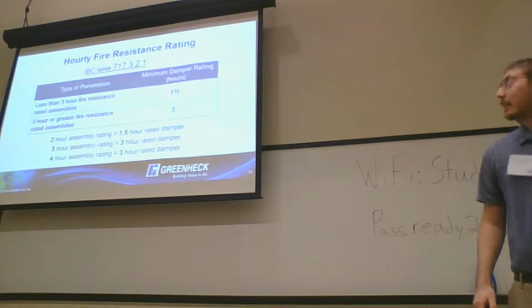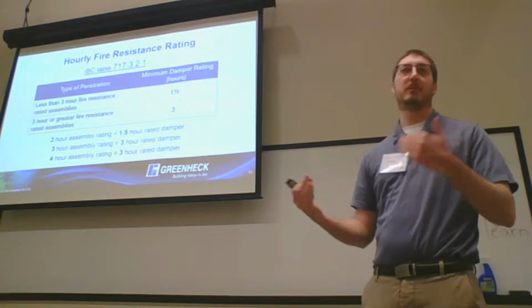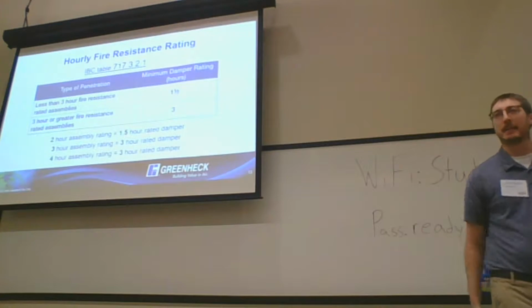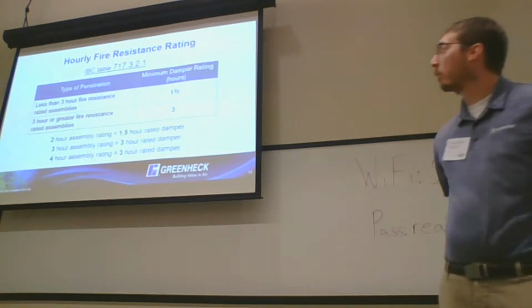All right, touched on this a little bit in the beginning. Hourly fire resistance rating. IBC and UL have a long-standing disagreement on what notation to use. You'll see UL hour-and-a-half rated and UL 3-hour rated products, and then you'll see building plans specify 2-hour, 3-hour, and 4-hour assemblies. What does that actually mean? How do they jive?